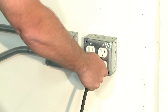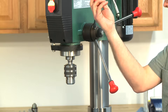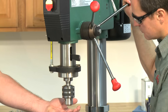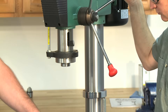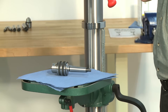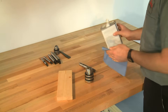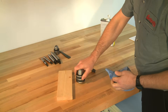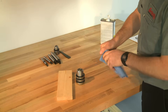To assemble the drill chuck and mount it to the spindle, first disconnect the drill press from the power source. If you need to remove the chuck from the drill press, lower the spindle down and drive the taper drift key into the slot. Gently tap the drift key so that the taper breaks the bond between the tapers and pushes the chuck out. Keep a towel on the drill press table or hold the chuck so it does not fall on a hard surface. Use lacquer thinner or acetone to thoroughly clean the drill chuck, arbor, and spindle sockets, and dry all surfaces before assembly. Failure to clean the mating surfaces may cause the tapered fit to loosen during operation, resulting in separation and an unsafe condition.